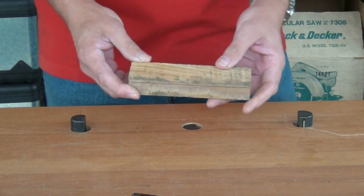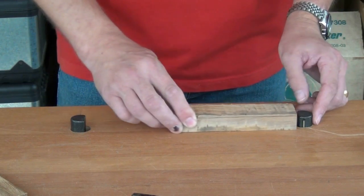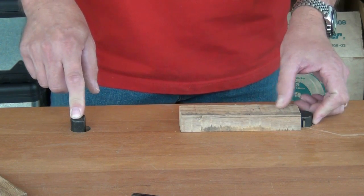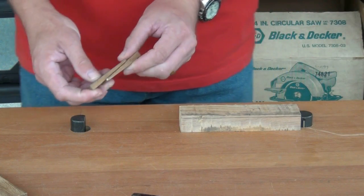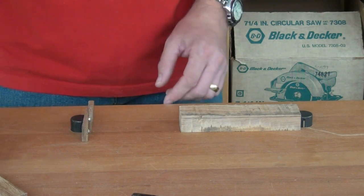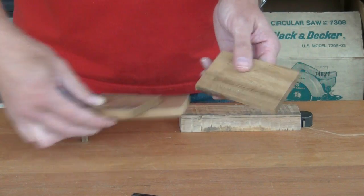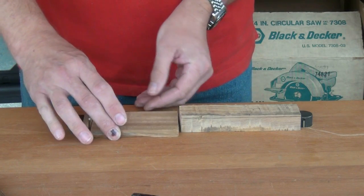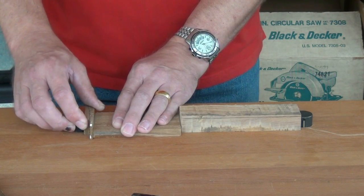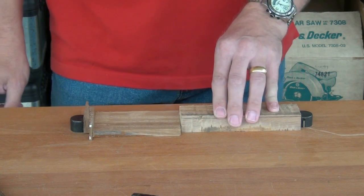To work on the same piece of wood when we don't have a tail vise but we have bench dog holes: place the work up against one bench dog and insert a bench dog into the next available hole. Then take a pair of folding wedges set as narrow as they go against the bench dog, and sort through your various spacers for the one that fits best. Then fold those wedges, sliding them against each other until the work is held really tight.